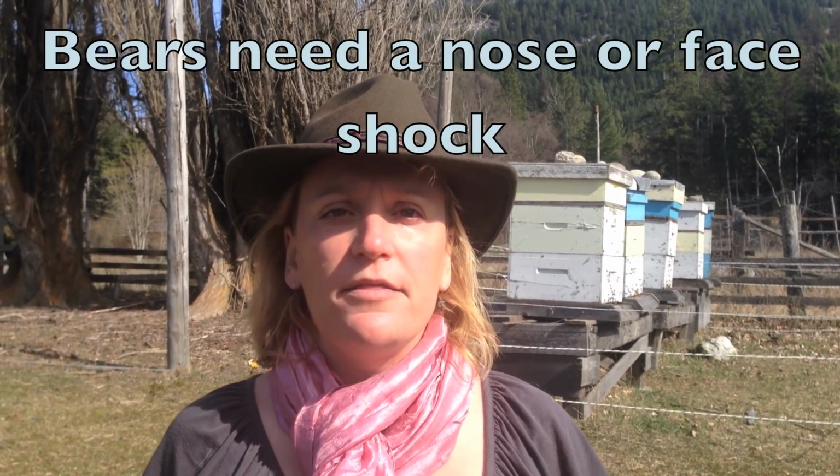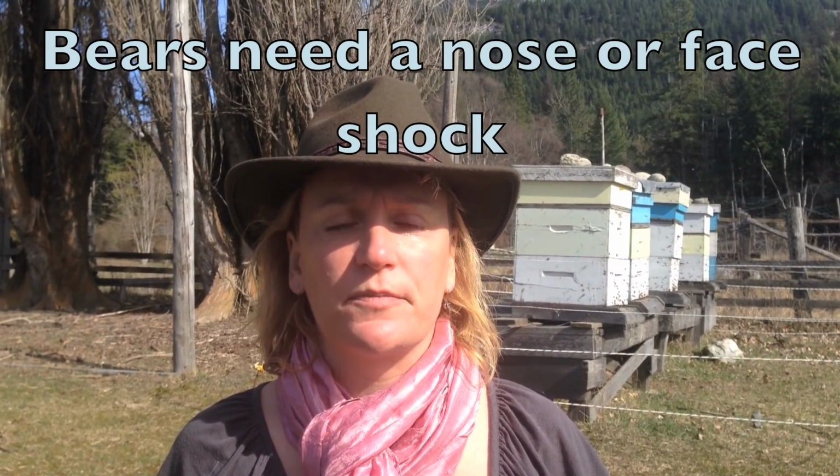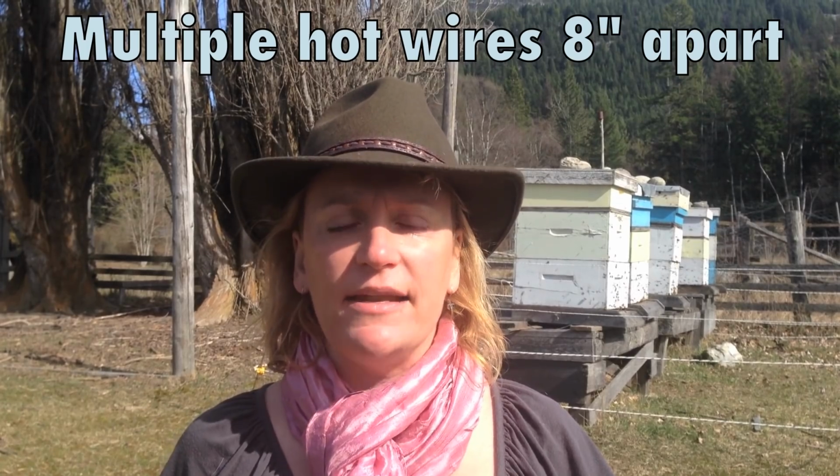For bears, it is very important to remember that their thick fur can actually insulate them from the shock. Therefore, I go for a nose or a face shock to deter bears. I set up multiple hot wires spaced at about 8 inches apart. Bears' noses are wet and sensitive. It's how they gather information about the world, and the nose is the leading part of the body.